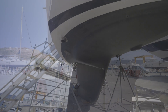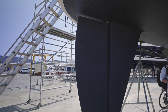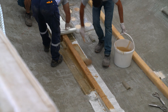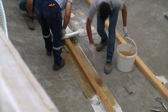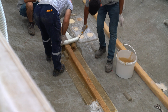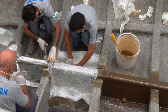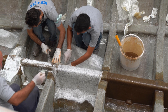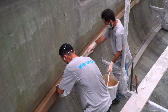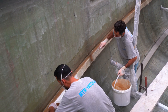In the skeg, we use layers of carbon to achieve additional stiffness. Overall, there's quite a lot of materials and combinations which are used during the build. There are up to 22 layers of fibre in our laminate matrix, which contributes to Kraken's strong structural stability — especially when you compare it to other yachts on the market today — and this more than prepares our yachts to take on the rigours of ocean sailing. However, just the fibres on their own are not enough to create the structure required, so it's also extremely important how we use them and where we use them. This is a topic of structure and the design we utilise, which we'll cover in a future episode.